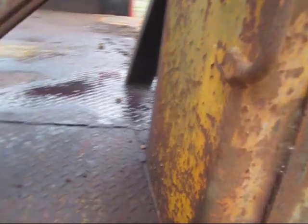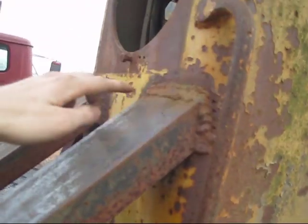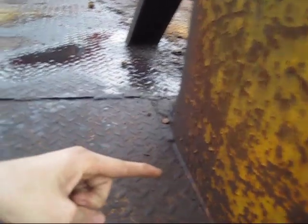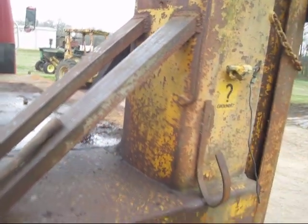We may make some, I don't know, maybe 8-inch gussets, really, really long, some pretty good thick plate, maybe 1/2 inch or 3/4, and run up the side here, you know, to the bottom of where the shield goes on, and they'll stick out about that far. And we may put two at an angle, like pitched out, and then one in the middle. So I think that'll more than suffice for these big long ones here.